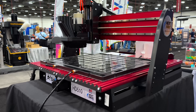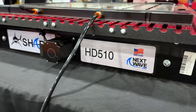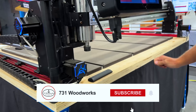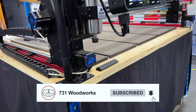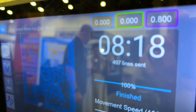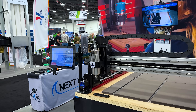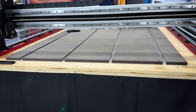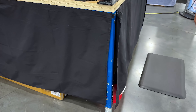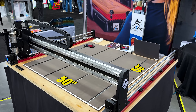This would be perfect for small shops — fits in any garage. We even go smaller if space is a problem. Our brand new main machine is our 4x4. This machine has rapids up to 800 inches per minute, going to a thousand soon. We have our new 10.1-inch pendant, which can be put on any of our machines. Machines currently come with a 5-inch screen, so you can upgrade. This machine includes the 3-horsepower spindle and everything you need except for the table and the software, which is Vectric VCarve. You can put a spoil board on it — this is an easy-to-build Kreg table. It has a 50x50-inch cutting base and 7 inches of Z-travel.